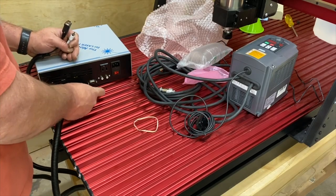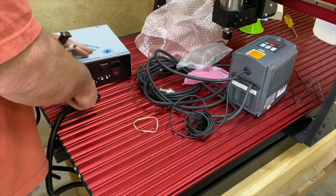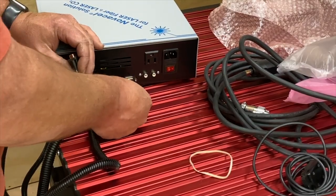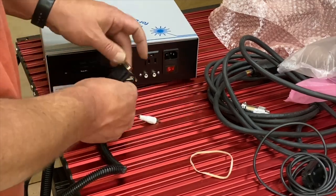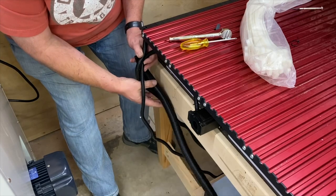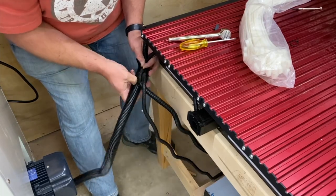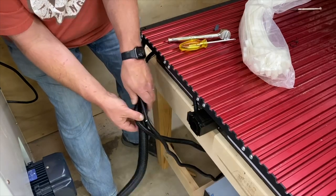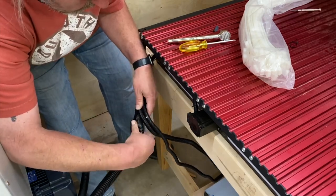Next, connect all your cables — they're labeled X, Y, and Z, so plug X into X, Y into Y, and Z into Z. You have two homing plugs, the little white RCA cables, and two jacks for them; it doesn't matter which one you use. Connect your X, Y, and Z cables, then your power cable. Make sure your control box is positioned underneath the machine and out of the way. They send you a large cable management tube — wrap it around the two sets of cables coming out of the front, then use the included zip ties to close it up and attach it to the cable carrier to keep cables out of the way.